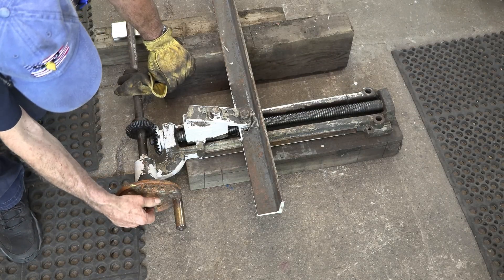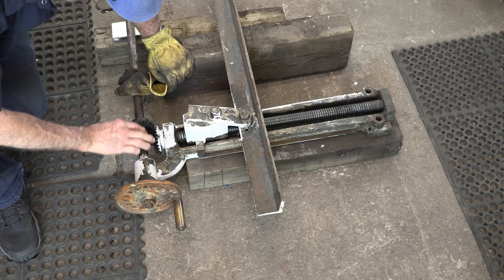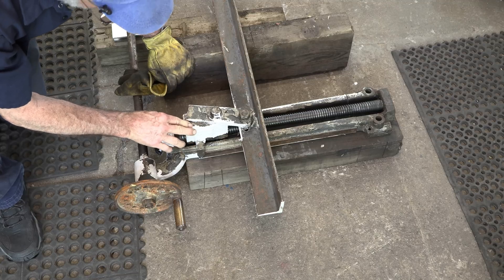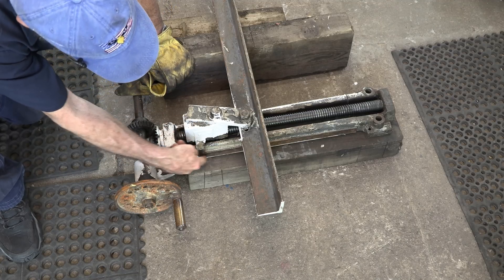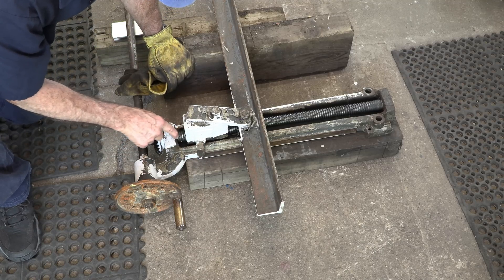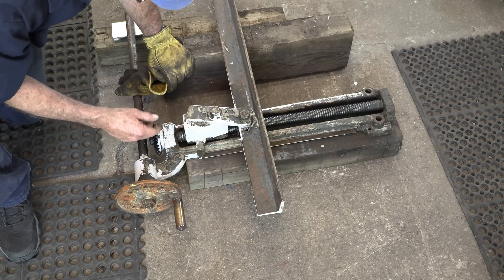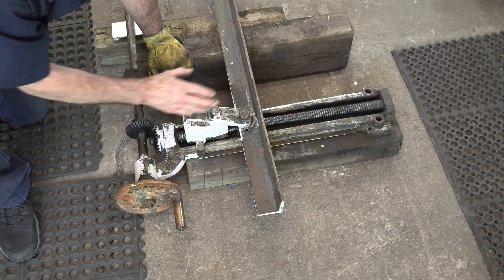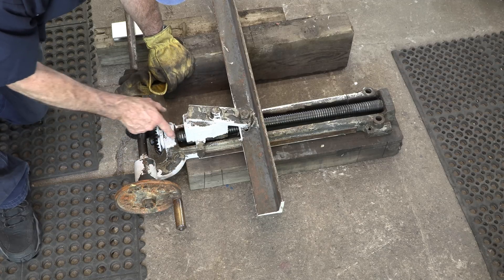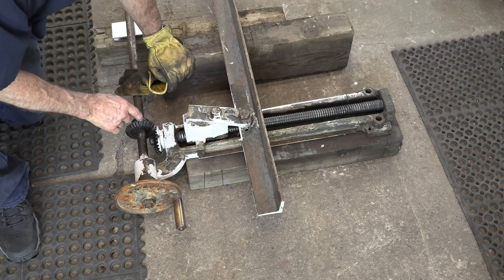This should be fairly easy. I'm going to get wrenches in here, we're going to pull off the wheel, and after that wheel's off, I've got to break loose this from the backstop from the adjuster. This is marked at whatever position it's at. We'll worry about timing after the fact, and we're going to do some measurements here just to make sure it's close to where it's at when we put it back together. All of these are adjustable features, but we know basically where it's at so we can get it pretty close back to the same position.